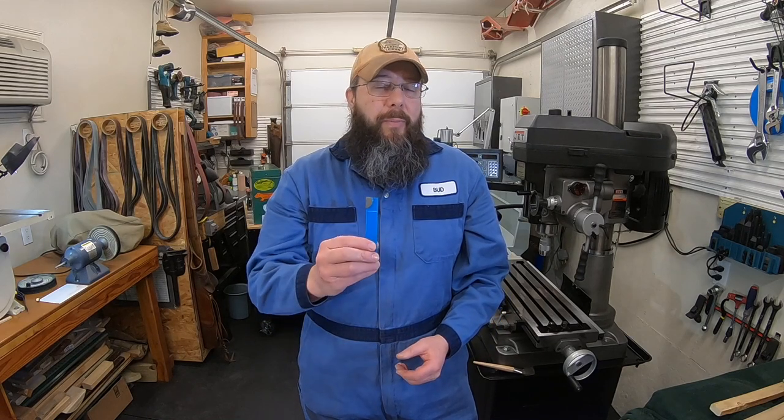I have a pretty practical project, I think, for us today. Maybe even something you're going to need to build for your own shop. My issue is bench grinder space. Now that I've got the lathe and I need to sharpen some of these brazed carbide tool bits, I've got a 72-inch belt grinder and I've tried silicon carbide belts to sharpen them. As you get it sharpened, it just rips the abrasive off of the belt and it doesn't last very long. So it works, but not very effective.